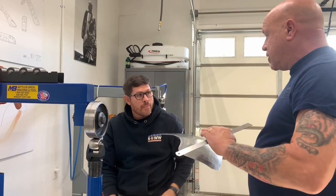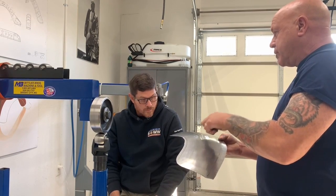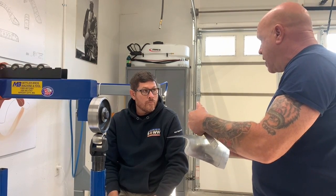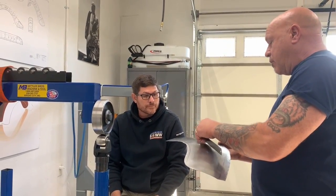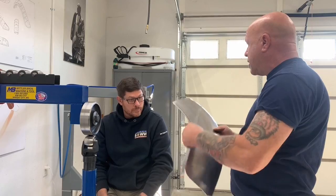Well, it's just the nature of the beast that as you wheel with a flat top wheel, it's not allowing you to get that constant curvature. So now you want to see, well, how close am I? I've done some wheeling, may not be enough, it may be too much. I don't want to go too much, so I'm going to gauge it so I can see whether the panel fits on the buck and has enough shape.